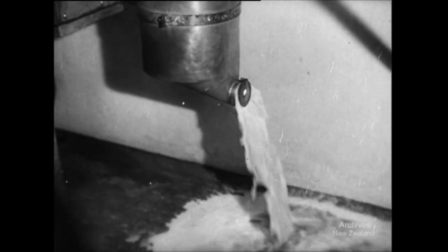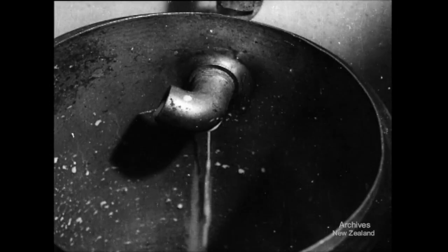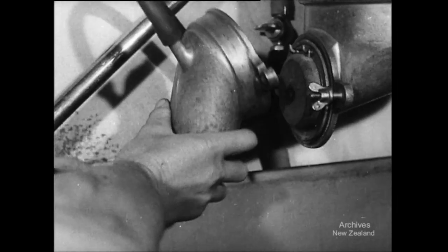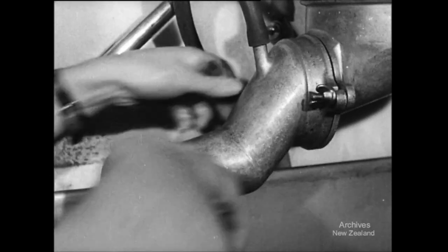Here's trouble in a big way — profits down the drain instead of into the vat. Quick action is called for. The releaser has flooded and milk has got into the airline. It has also got right through in behind the inflations. The trouble is probably due to leaky flaps. These should have been tested before milking started — it's a simple job, but it can cause havoc if it's neglected.